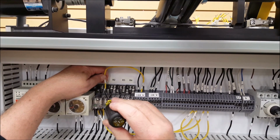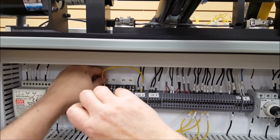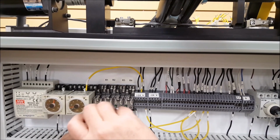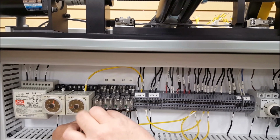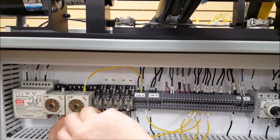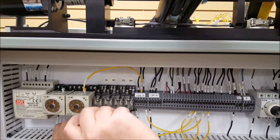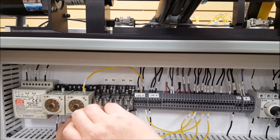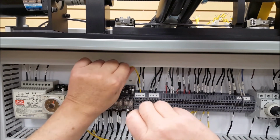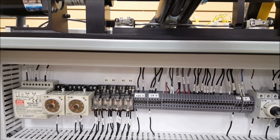We want to remove the wires that were put in during the lab. So we're removing them. Loosen the screws, and the ones that only have one wire that we put in, just go ahead and loosen the lug, and you can go ahead and leave it loose. The one on the bottom has two wires in, our plus side of the coil, plus there's another wire that went out to the front panel to the LED as an indicator saying it's energized. So when you take out the yellow wire, make sure that other wire going to the front panel is still there, and snug it down. And have it ready for the next guy. Let's zip through it and clean it up.